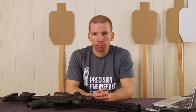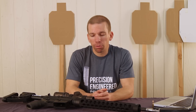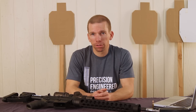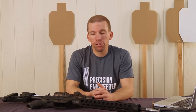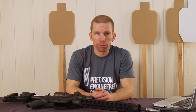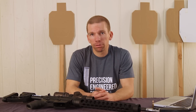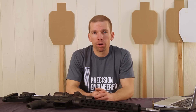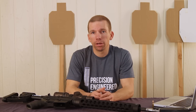So when you look at what happened that day, the real problem isn't so much with what I did in the field — it was with my reloading process. That round didn't have enough neck tension, and the bullet was able to get forward and stick in the lands, which led to all of the other problems. So after figuring that out, I sent the video to the guys at JP. They took a look and concurred that that was most likely the problem. I went back through my reloading process, adjusted my dies, fixed that, then took all the rounds I already had loaded and ran them through that portion of the reloading process again to make sure those bullets were properly seated with the right amount of crimp and neck tension. Since then, I've shot somewhere in the neighborhood of 30,000 rifle rounds and haven't had a problem. So if you are reloading, pay close attention to that because it is a problem that can sneak up on you and it's going to bite you sooner or later.